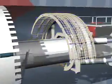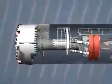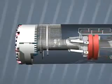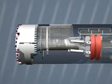Another example is a mesh placing machine. This travels over the anchor drill and places steel mesh behind the protective roof to give protection against falling rock. Which securing measures are most effective against rock falls depends on the local geology — in one place steel anchors are best, whereas in another it may be steel mesh, caps, or arches.